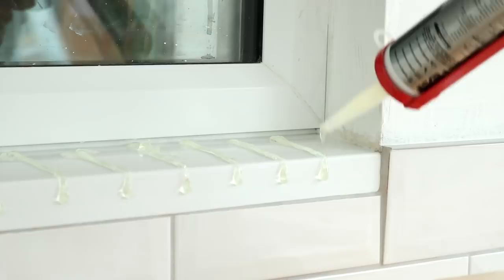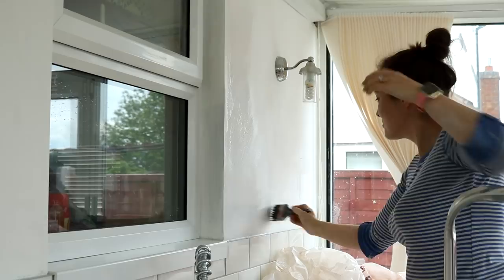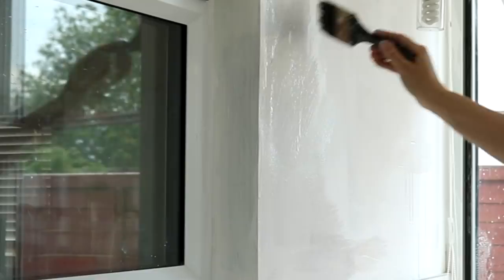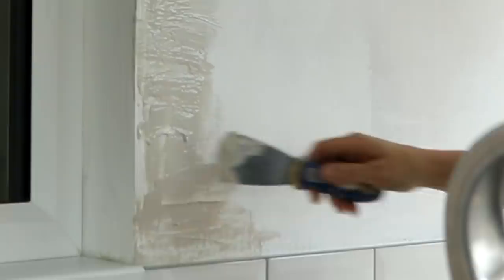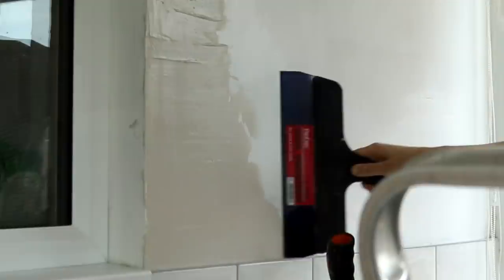Now onto my snagging list, which is always tedious. You might notice the walls are white now because I asked my husband to paint everything so I could see if any flaws were visible — I found this a much quicker method than just diving in and filling everything you see. So I'm brushing over it with more PVA solution, leaving it to dry, and then going over it with some Wickes Instant Skim from a tub I had a couple of years ago — thankfully it hadn't gone off. I apply it, go over it with a vinyl smoother, and once it's dried it's one of the easiest things to sand down. Any slight dips you can always fill the imperfections the next day, because there's a lot less by then.